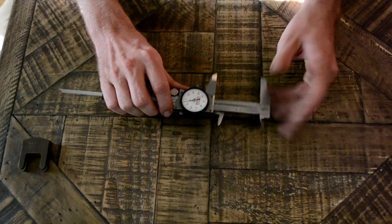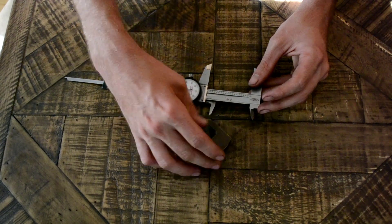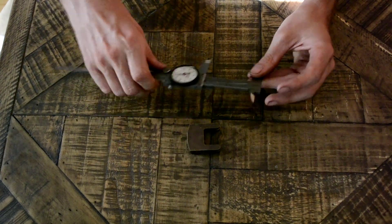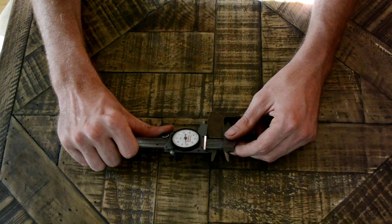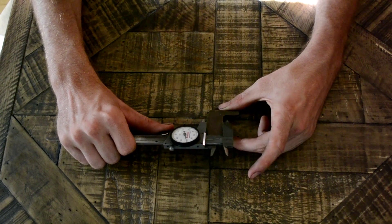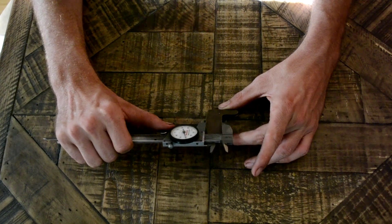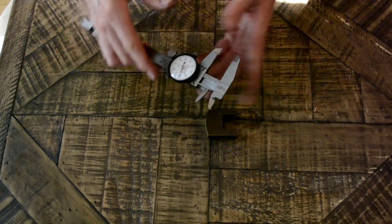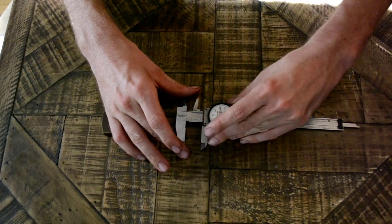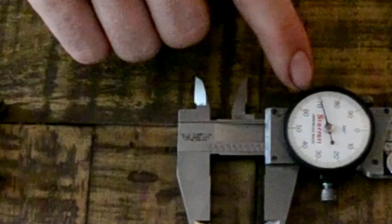Let me show you a little bit about technique on how to measure a part. If you can hold the part in your hand that makes it easier, but you can also place it on a table and cinch up your calipers to it. There's a touch to it — you do a little wiggling, then try to pull your calipers off as smooth as you can. You can read them with it on the part, but if your dial doesn't move when they come off, you should be close. We're at the eight on the scale and just past 70 on the dial, so this is 871 thou.